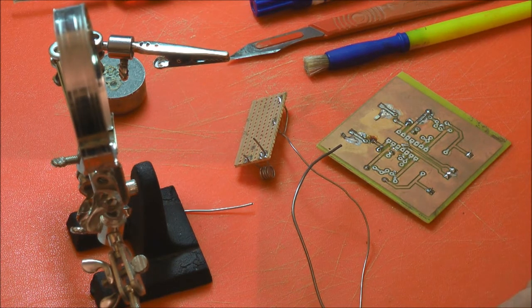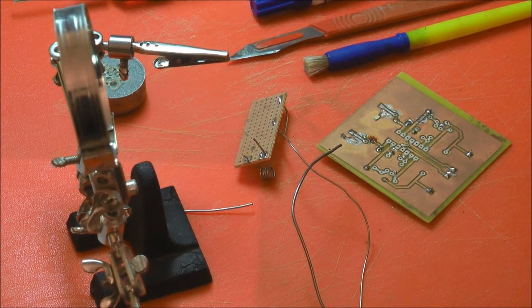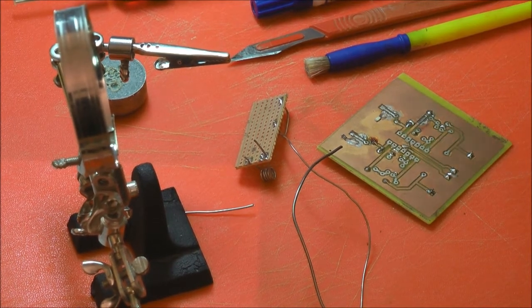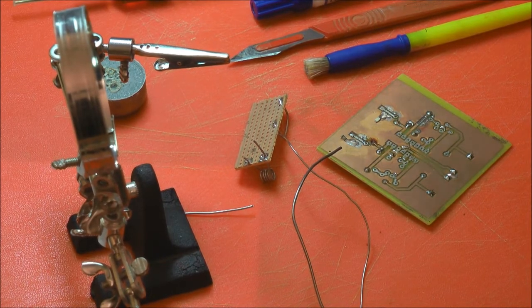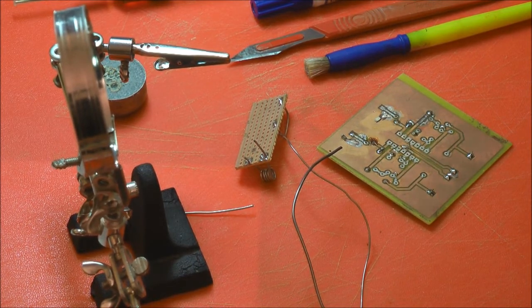You're familiar with solder suckers, solder wick? Yeah, I think I've heard of them, but I don't know what they are. It's a spring-loaded bicycle pump. It has a piston inside. It has effectively a trigger. So it's spring-loaded, so it's like a back-to-front syringe. So when you press the button, it stops, so it sucks. So while the solder's molten, you can bring it in close contact.